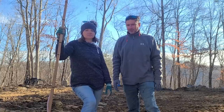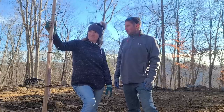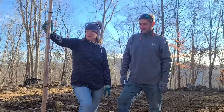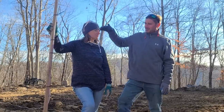I love the water level. I'm glad we made it. This is awesome. You just walk around and boom, put it wherever you need it to go. Much better than my stick with the pink string. Highly recommend the water with the bucket, because it makes it even out a lot faster. And raise the bucket high so it's got some pressure.